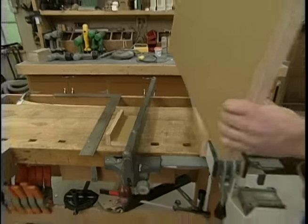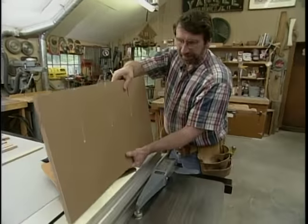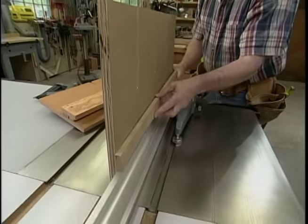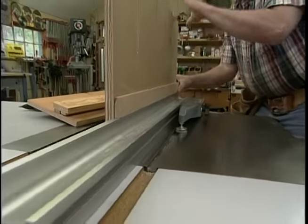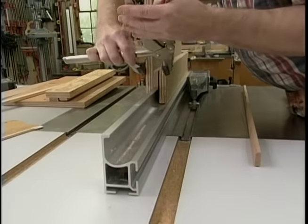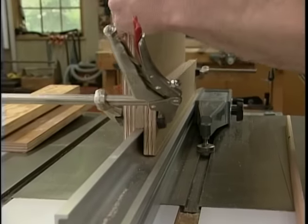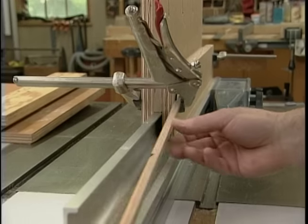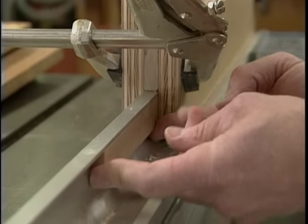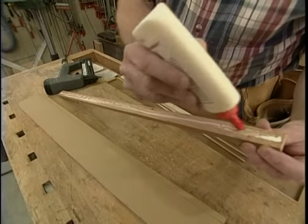Now to finish up our jig, I'm going to bring the panel over to the saw, set it right on the table, and take a piece of cherry that I've planed down to the same thickness as the top of the extrusion and attach it with a couple of brads. Now I've got another piece of three-quarter inch plywood that goes on the other side of that filler, and I'll just clamp it in place for now — that slides pretty good. Now I've taken another piece of stock and thinned it down so that it fits between the piece of plywood I just clamped on and the extrusion. This will allow me to put a couple of pencil marks on; I'll take the thing apart and glue, brad, and screw it together.